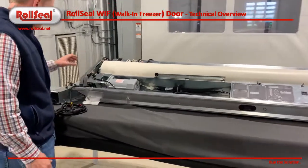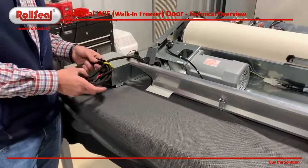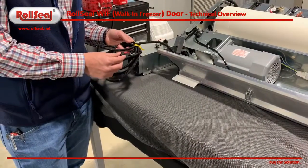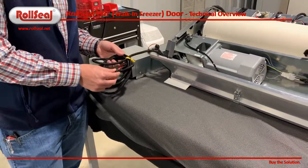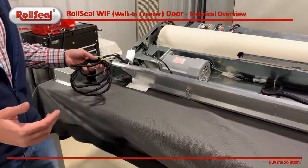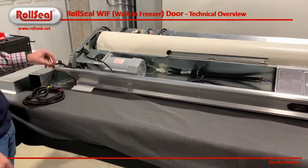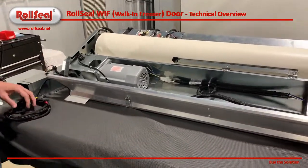Moving around to here, I've got my harness that will go down the track. This will be connected to the photo-eye, or the safety beam, which will allow for auto-reversal back to the open position if it's ever broken while the door is closing, and wait for that signal to come back.